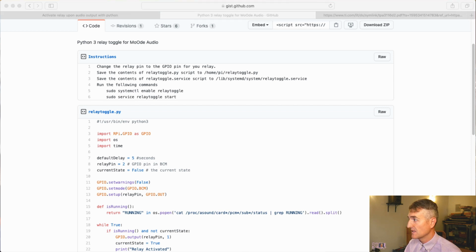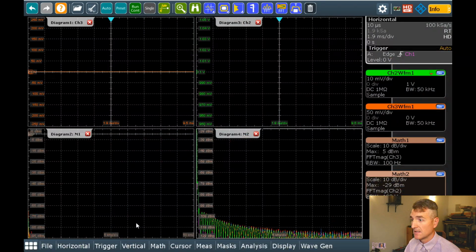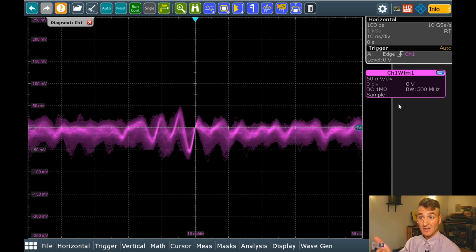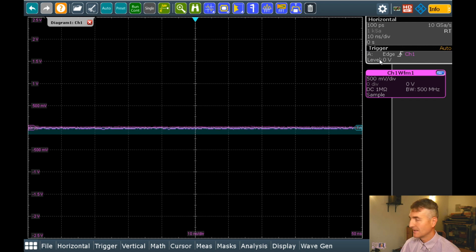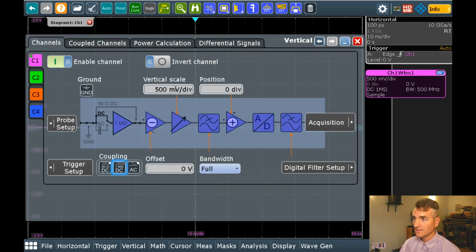If I go over to the oscilloscope, we'll be able to use channel 1. Right now it's set up from something previous, but look, boom, channel 1. So we are monitoring GPIO 12 right now. Let's get this thing scaled right so it'll at least fit on the screen when we can see it. Move it down a little bit, scooch down.